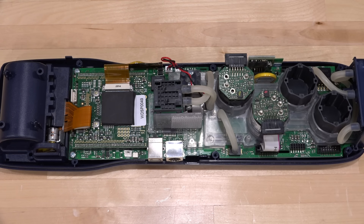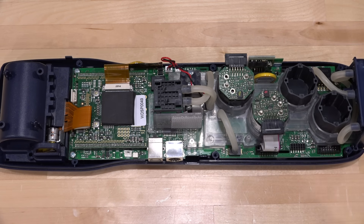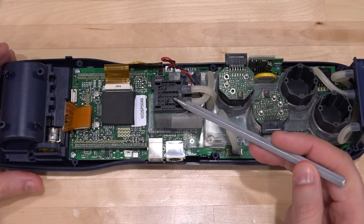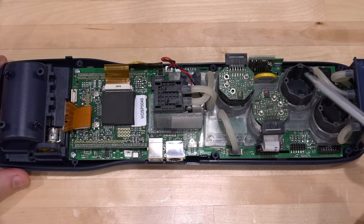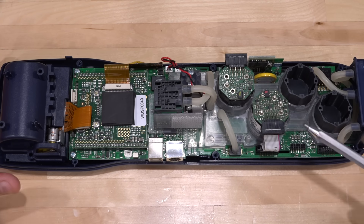Here's what's inside of this instrument — really different than other instruments we look at, because it has pumps and pipes that have to move gases around and interact with the electronics. We have room for four sensors, and these two are not populated. These are plugs you can rotate and pull out to add additional sensors with a standardized form factor. We do have the oxygen sensor here, which is not working, and then we have the carbon monoxide sensor over on this side, which seems to at least not give an error. There's a pump creating negative pressure allowing gas to enter the unit, entering this acrylic section — two parallel plates with channels built in — allowing the gas to move and pass the membrane of each sensor and then exit the instrument.